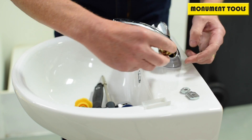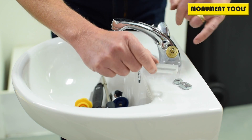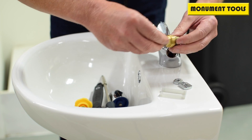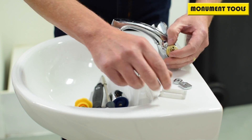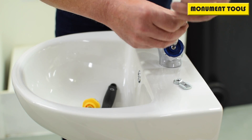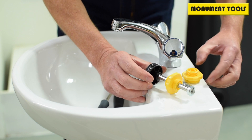We've fitted our new washer and we can now reassemble the tap very easily. There is a small plastic fitting supplied with this — the purpose is to stop it rolling off the packaging, however it's also very good for holding the jumper unit while you're working. That's now solved our problem of the leaking tap. That's the Monument 450p DIY tap reseating tool.